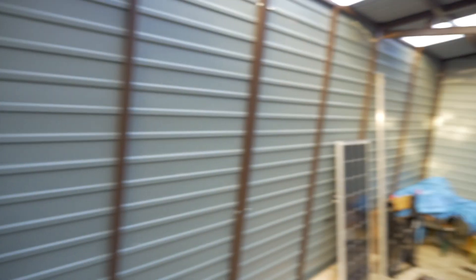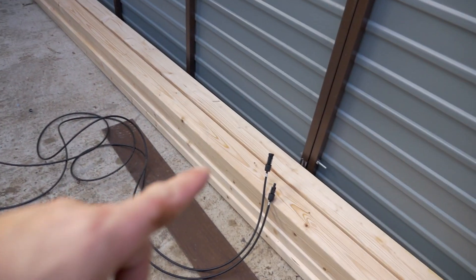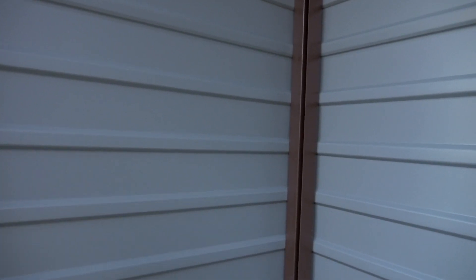So the solar panel works. Next stage is putting the solar panels on the roof. What I need to do is take the solar panel — I've got some brackets which I need to attach to the roof, and I've got some cables which I'm going to route through this roof panel. Then on here I'm going to put a board, put the MPPT controller on there, connect the battery up to that, and then the solar panels down to that.